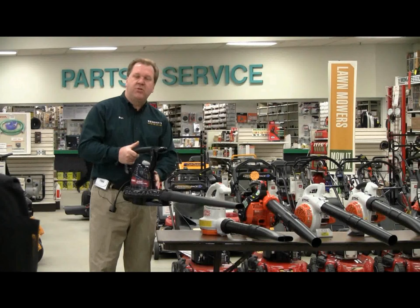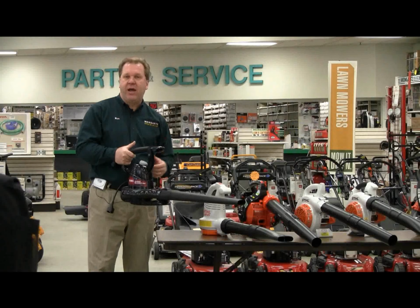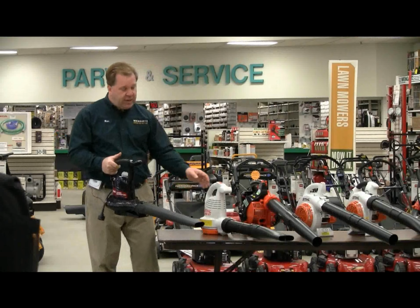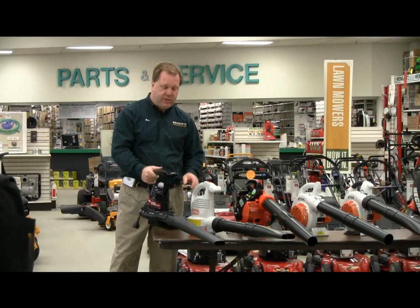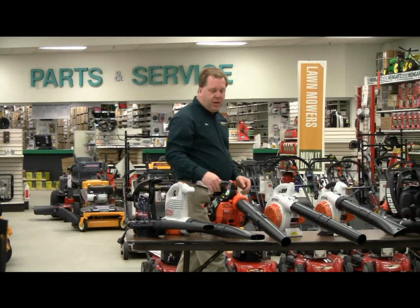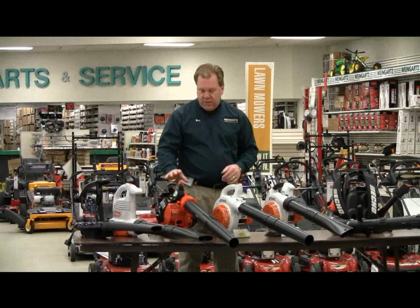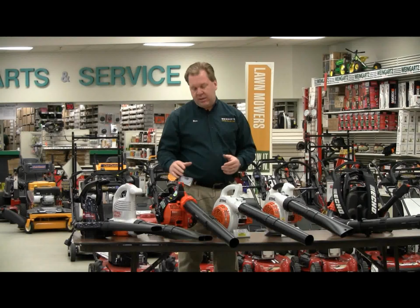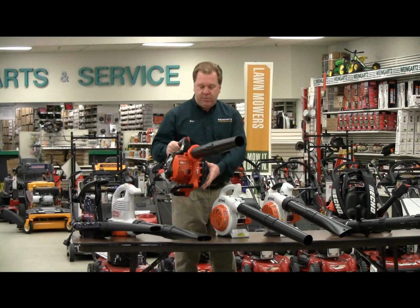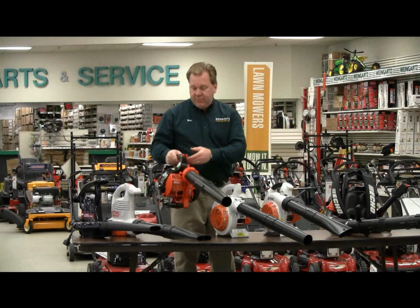In your typical electric blowers, because they are a high-speed motor, they have excellent air speed, but they don't have the volume of air that many of your gas blowers would have. There's many excellent options, excellent brands in the electric powered units. As you move into the gas units, they're available in different size displacement engines. They can run a larger diameter fan to give you increased performance. Your entry-level machines pick up a little more weight than the electric, but they're still fairly light.